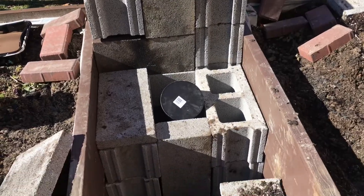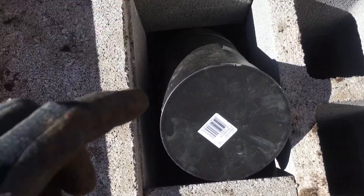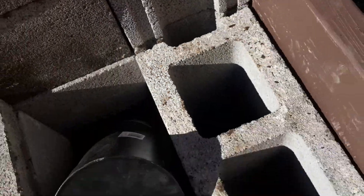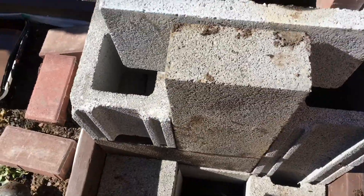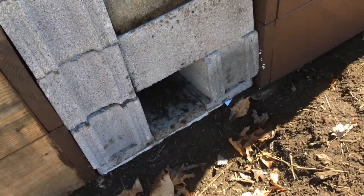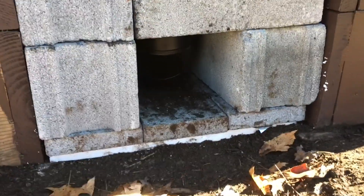It'll go out pretty quickly. This is open space for now for the actual exhaust to roll around and exit out the back. These areas here are the thermal mass — all areas that go down need to be filled with sand, rock, or gravel. All those areas will be filled up to the chimney. This little thing here is the top of the chimney, and we do have air in here around the chimney so you can get the fire going, then cap this off. The air circulates around this open space that doesn't have any gravel in it, and then exits the exhaust, which is on the same level that the fire comes in.